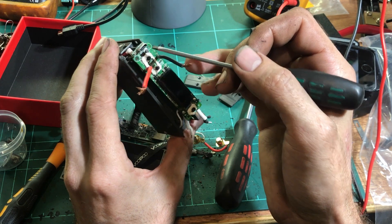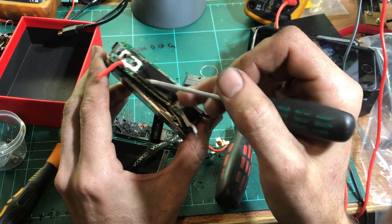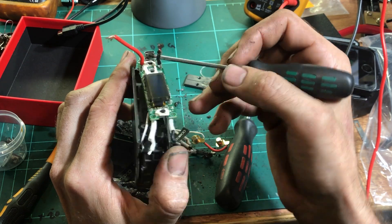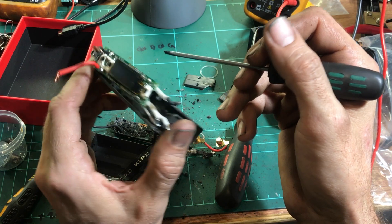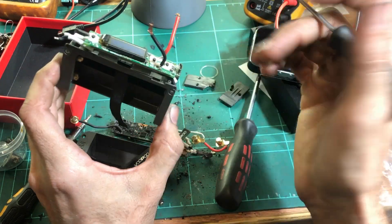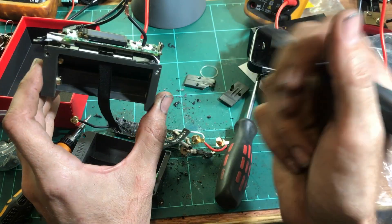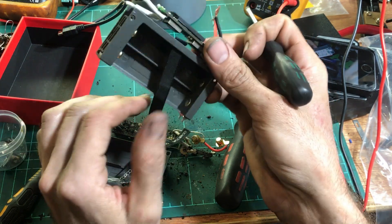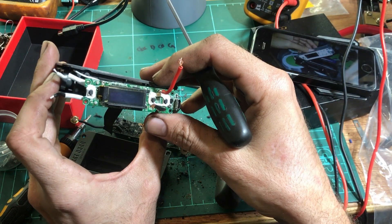Also you could probably tell by shining a bright light in the USB port — juice is going to run down this way and there are holes in the USB port just there, so you'd likely see some gunk caught up inside the port, which could be an indicator that it's gotten juicy. Now if your drag hasn't had any juice contact over its lifetime and you're pretty confident with that — do you continue using it? It's only a few, but it does make you wary, that's for sure.